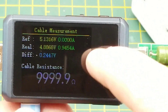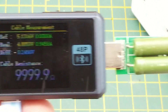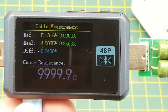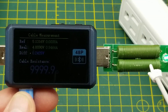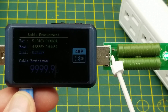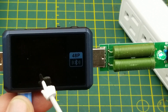The last mode, flipping that switch to the right again, takes you to the cable measurement mode. From what I read in the manual, for this you need a constant current load. This isn't constant current — I used to have one around here but unfortunately it died. I've got another one on order. Regardless, you plug about a half amp to one amp load onto it, zero it out, then put the cable in between the load and the meter — either USB-A or USB-C — and it will calculate the voltage loss and resistance.